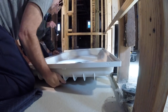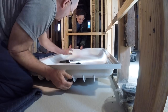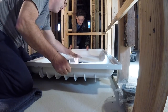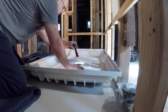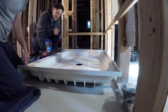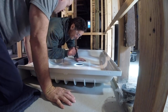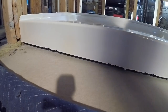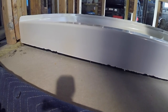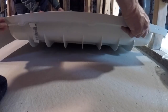We're up — lift your tail, grab that in. We're on top right now. First try! We're right on it. So we've got to cut another quarter inch off. This shower is a pain because you really have to get a precision cut, and there's no easy way besides taking it on and off. The floor is a little out of level — we're going to fix that with a little thin-set.